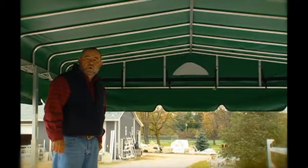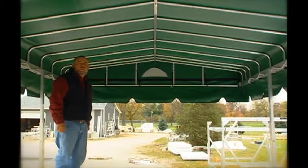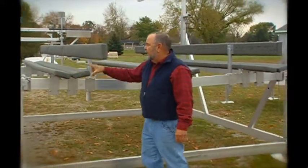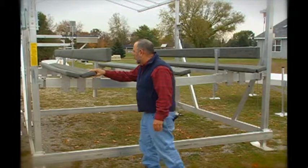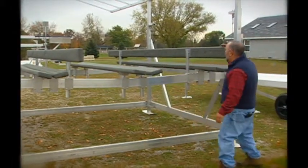Our canopy lengths are 20, 23, 25, and 27 feet; 30 can be ordered on a special order basis. Here we have a 3,000 pound vertical lift which is configured for a tri-toon. It's equipped with a pair of standard tri-toon bunks, a pair of standard utility bunks, and utility side guides.